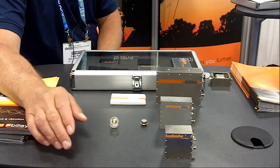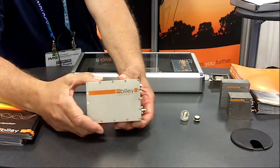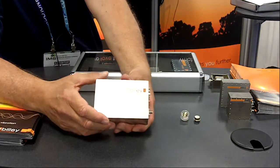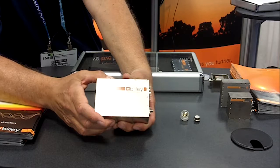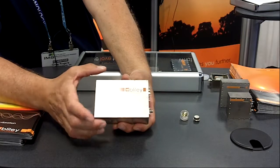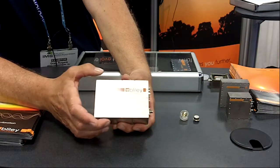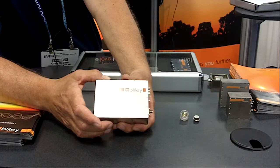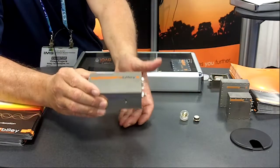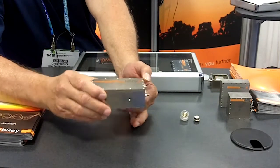These will be selected in oscillators for lower G-sensitive processing. The next form of nullifying the G-sensitivity properties of the quartz crystals is to mount the entire oscillator onto a platform. This is our Poseidon 1 product — it's a mass or plate which we mount on springs, and we tune that using various weights of the plate as well as spring constants. Through that motion, we can offset some of the G-sensitivity in each of these three axes.